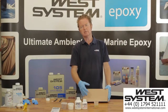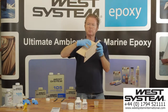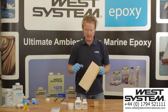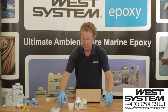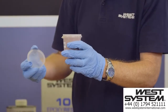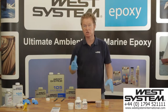Now, one of the techniques involved in stitch and glue is to create a fillet. A fillet is a cove of thickened epoxy that becomes a structural component of the whole boat construction. It's a method of joining panels together in a very, very lightweight, efficient way. And for that we need to use our West System resin and hardener. But on a small dinghy we can use our low density filler. Our low density filler is a very lightweight filler, really intended for filling and fairing. But on a small dinghy this will create a very lightweight, very strong fillet that is actually stronger than the